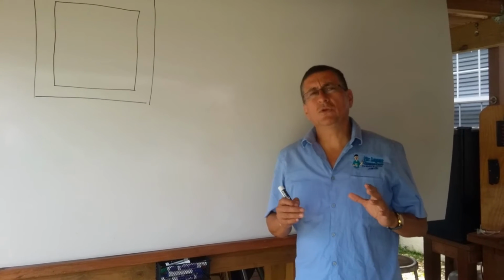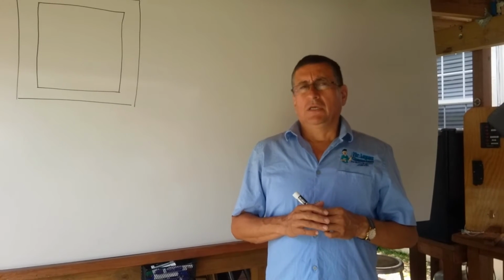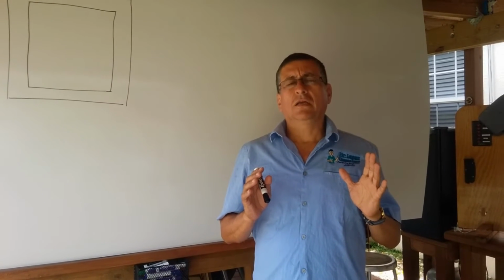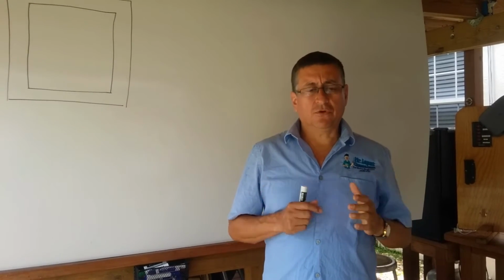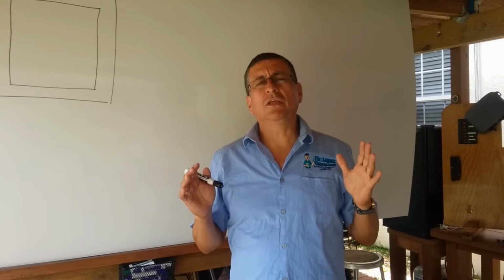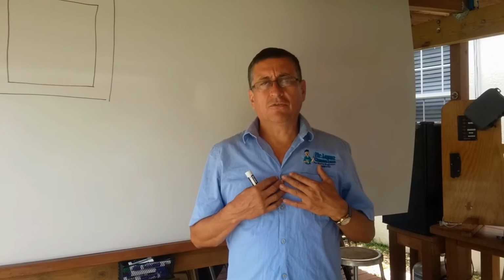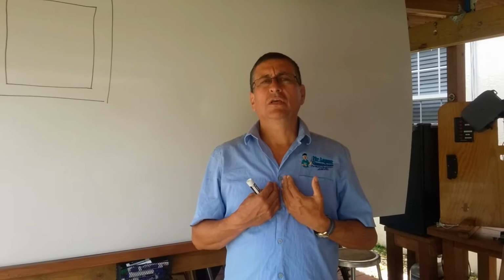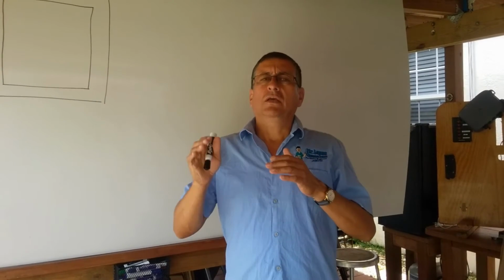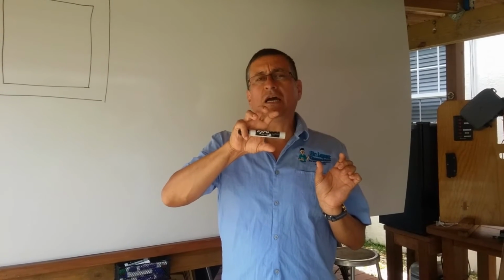Now I am going to explain the procedure to wire a transformer in the panel of your boat. Remember, you have 3 possibilities for a transformer: isolated transformer, step-up transformer, or step-down transformer. An isolated transformer is mandatory in the wiring of a boat. Where should the isolated transformer be located according to my recommendation? I recommend installing the isolated transformer after the switch selector, in between the switch selector and the main panel on the AC panel.